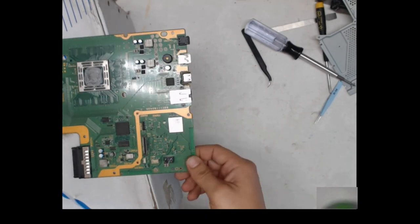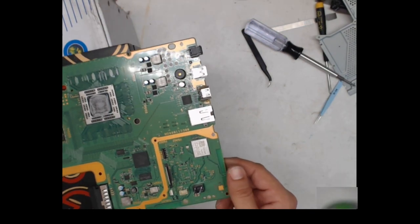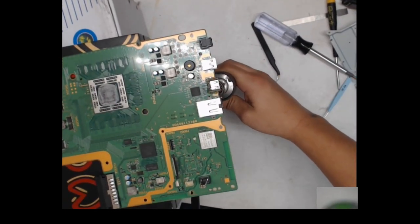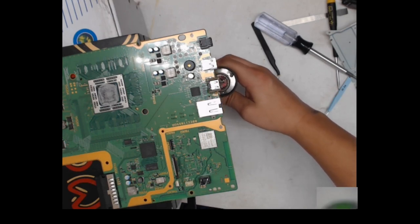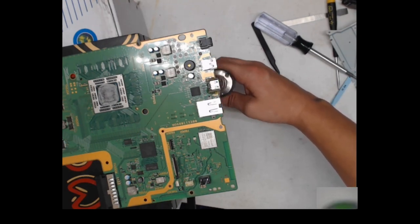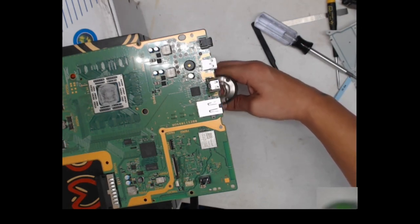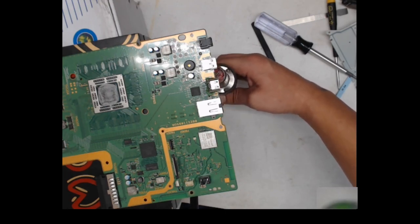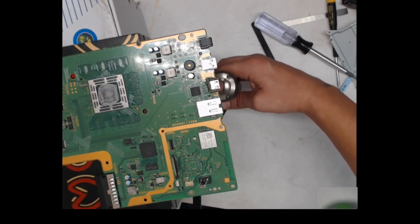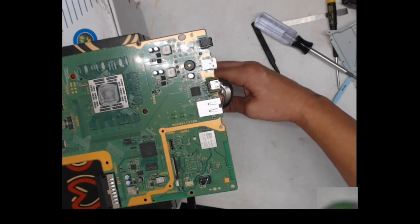Let's try this, see if that does any better. Wish I could get any closer, guys, but camera sucks. So 420 Celsius, like I said. If you have low melt, it's always good to flip the board in the back, solder up the big posts, get those flowing nice, then come back afterwards with the heat. Me personally, I'm just going to pull it off real quick.